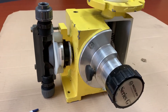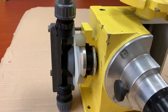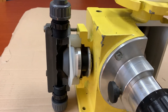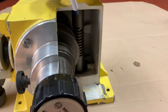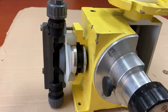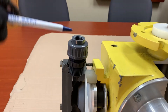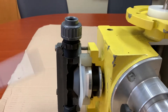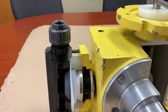For capacity adjustment, startup, and running — all you really need to do is flood the pump through and vent it on the discharge side to make sure you have process fluid all through the head. You need oil on the gear side of the pump and you're pretty much ready to go. If the pump is airbound or airlocked with a slug of air and discharge pressure is preventing it from clearing out, vent the discharge side, allow process fluid to come through, and the pump will take right off.